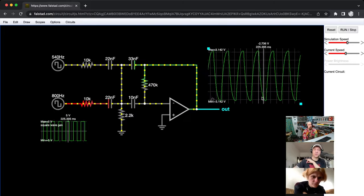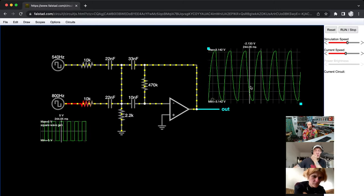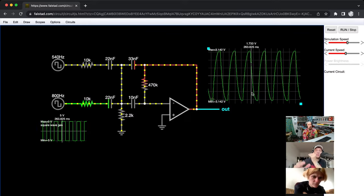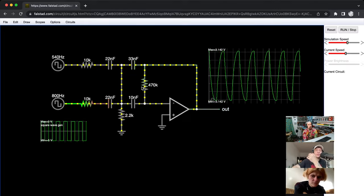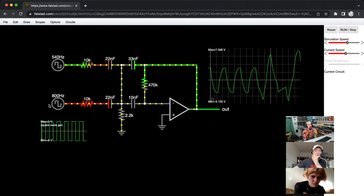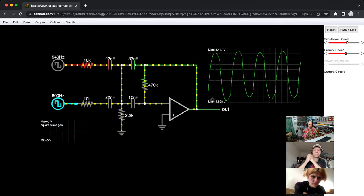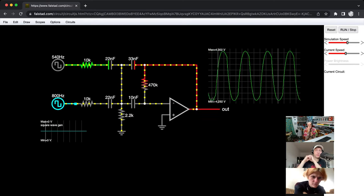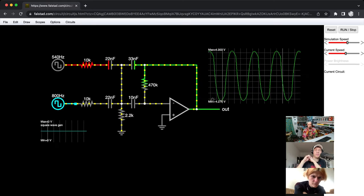But you can see in the output that now we basically just low-pass filter the 800 hertz signal, right? So it used to be a square, and now it's rounded off. So low-pass filtering, and then maybe let's switch on the other one, and we'll turn off the 800 hertz one. That also looks low-pass filtered. Though maybe the shape is a little weird, no?